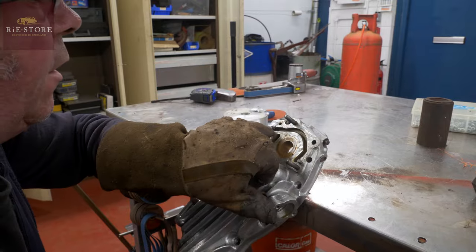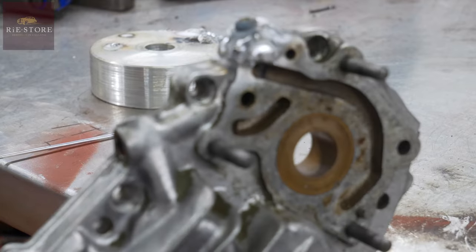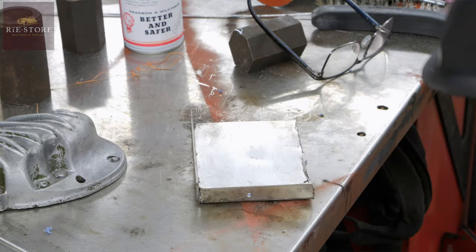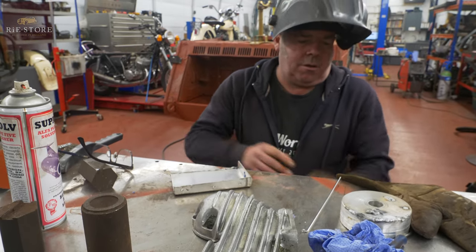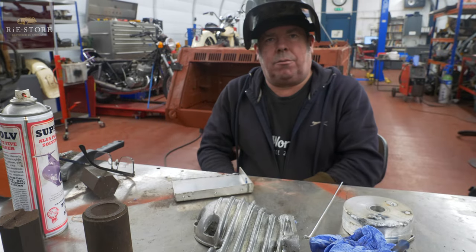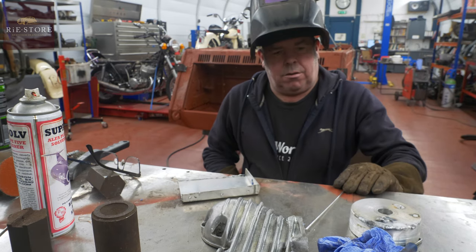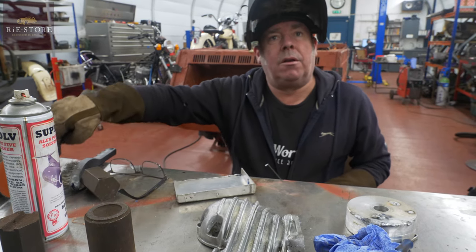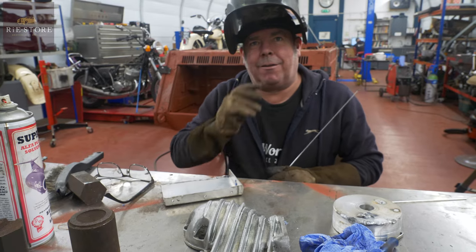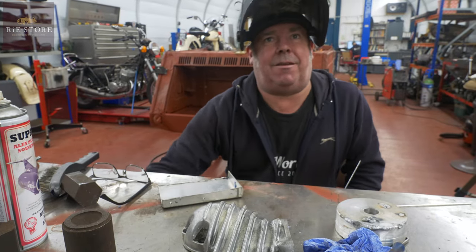And drill it out into that oil passage — you see the drill line there? So we've got to drill down into there and thread it for the new thing. Yep, that should be fine. Realistically that tungsten is probably a little bit too big for that but it'll weld. It's all about taking your time. When you're pulse welding and trying to make it look pretty, you sit back and take your time. A lot of people find it — it's very hard to believe — people hold their breath when they're welding, until you've learnt how to breathe when you're welding. It's a bit like shooting — if you hold your breath you don't get that movement in your body. Well no, you've got to breathe otherwise you just jam up.